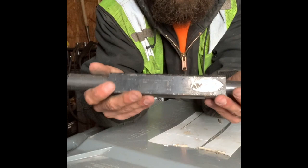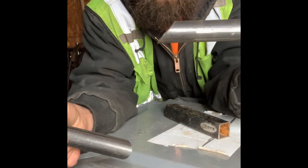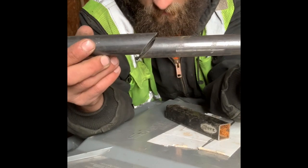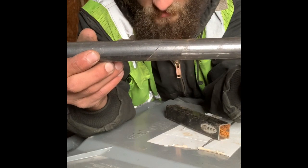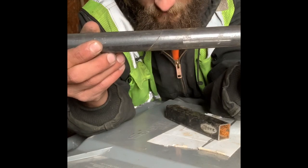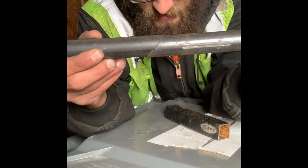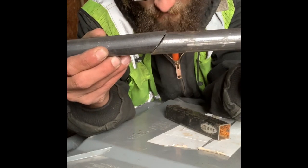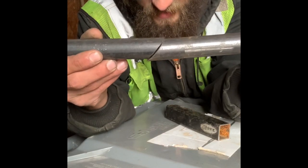The proper way to do it: cut your axle ends with about a 45-degree angle. Do your sleeve and everything and weld it just like this. What's going to happen is inside the sleeve, these pieces will have to fight each other — you can't just slip them away from each other.